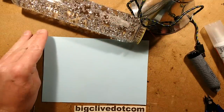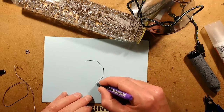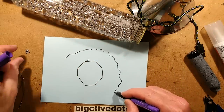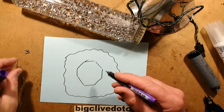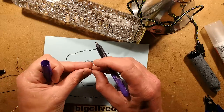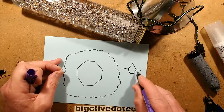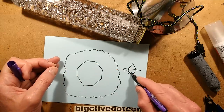It gives you a clue as to how these are made. So if this is the back of the diamond that is basically coated in the chrome, then there's this sort of flash around it. Flash is the over-injection of the plastic. They've injected the plastic, and there's this flash that appeared around the outside of the mould in a thin film. If you're looking at the side, there's the diamond, there's the back of it, and there's the flash. It's just this thin film of plastic come out the side. And it's chrome coated on the back here.